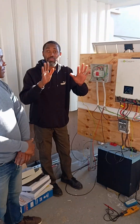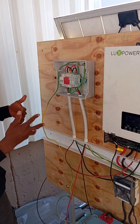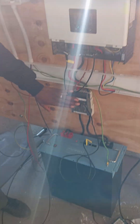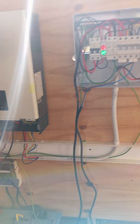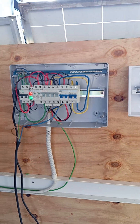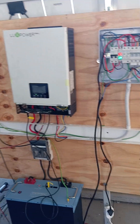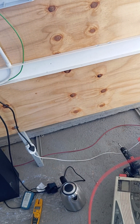So YouTubers, as you could see, we looked at a five-module setup. We had our combiner box and wired it from start to finish. We wired it to the inverter on one MPPT. We worked on the battery fuse disconnector, worked on the batteries, did our AC protection, and also explained how you separate your neutrals on your main DB. We also had a practical hands-on on how to crimp MC4 connectors — explaining the pin configuration.